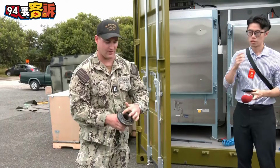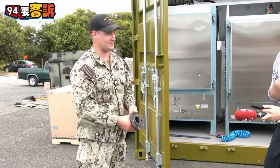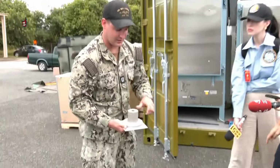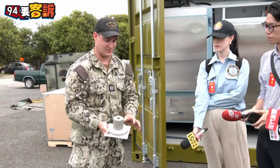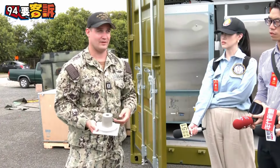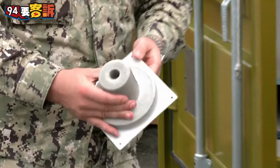It showed us that it corroded on the inside and was damaged, so we needed to create a replacement part for it. So that's when we printed off this one earlier this week. So this is the substrate, and then cold spray via plastic deformation would adhere to the substrate, and we built it up, kind of like spray painting with metal. But this was printed off in 2 hours, 57 minutes.